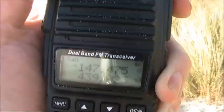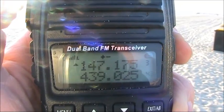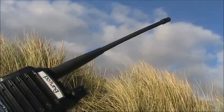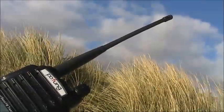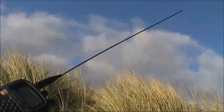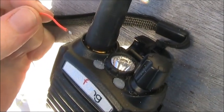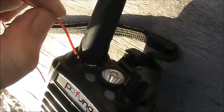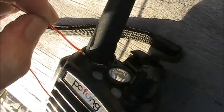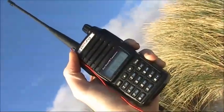Now what if the signal's noisy? The first thing is to look at your antenna. This one is only 17cm long compared to a full-sized quarter wave, which is 48cm. You can buy accessory antennas like this, and because this is almost a quarter wave, it's much more efficient. Another thing is that a transceiver case doesn't provide much of a ground plane, particularly on two metres. If you are able to get a connection to the chassis of the transceiver, then you could attach a wire that's a quarter wavelength, or 48cm long. If you have the quarter wave hanging down so it forms a vertical dipole, you should be able to get better signal reports.